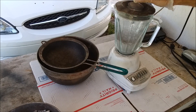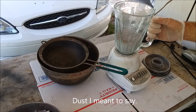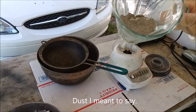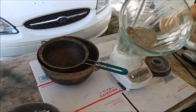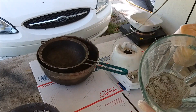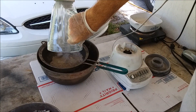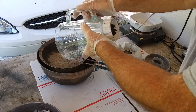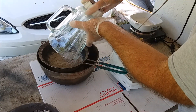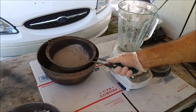There's some chunks of something in there flying around. Every once in a while a ceramic IC sneaks past me when I'm sorting the ICs out, so there might be a ceramic one in there getting torn up and throwing chunks around. When you first take the lid off there's a lot of powder — see, that's a nice light colored powder. It's not the black charcoal-y stuff I was getting when I was just pyrolyzing the chips. Now that I'm fully ashing them, that's a nice fluffy white powder. I'm going to dump this into this kitchen strainer and sieve it.